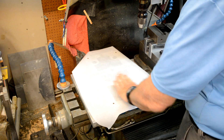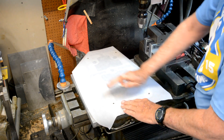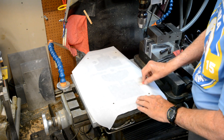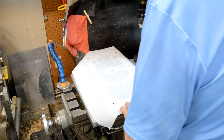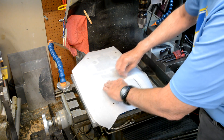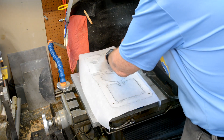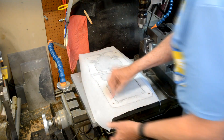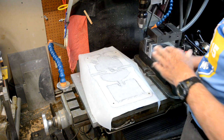This vise has a bunch of surfaces that aren't machined on the bottom, and I want to remember what's there. When I put the phenolic down, I'm going to leave most of it one solid piece instead of having separate pieces. So what I'm going to do — try this, see if it works — just rub a pencil on here. That gives me a pretty accurate layout of what the bottom side of the vise looks like.